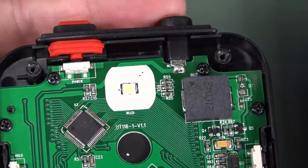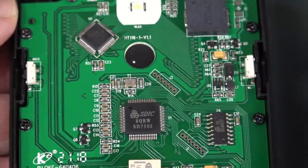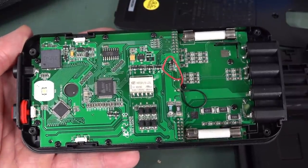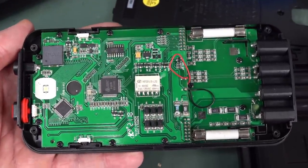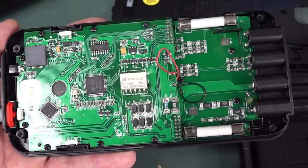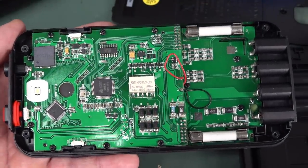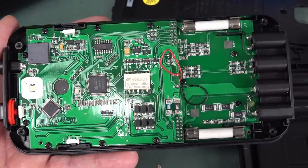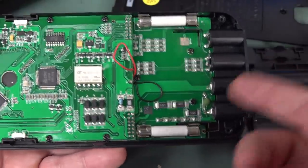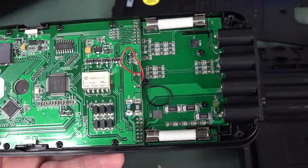But the non-contact tester up there, it's just the actual pad sticking out of there. So look, it's okay. You don't buy it for its CAT rating specs. You buy it because you like the price and the function. I don't even know what this costs. Like 20 or 30 bucks or something. Probably not much. But internal construction is okay. I mean, the relay, if you had a magnetic thing, you might be able to flip that or something. But it's basic for a cheap $20-$30 pocket meter with the one PTC and no MOVs and whatever.